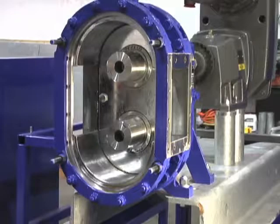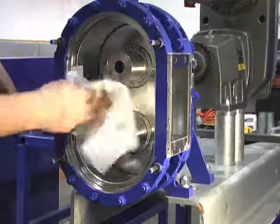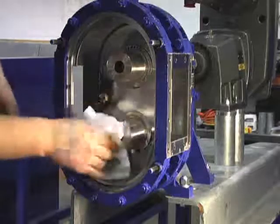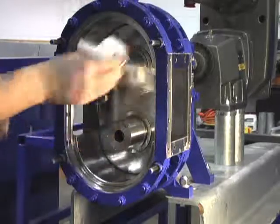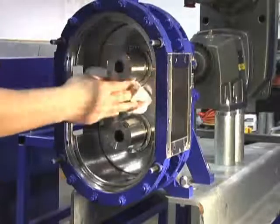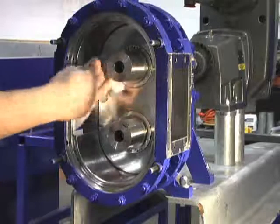It is important that your lobes are thoroughly cleaned whether they are new or used. This is especially important for the inside ring at the back of the lobe that touches the face of the cartridge seal. Both the top of the seals and the back of the lobes must be completely cleaned for a proper seal to be possible.